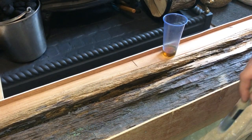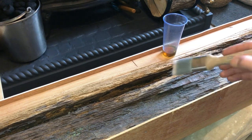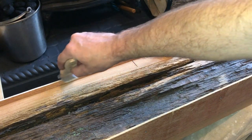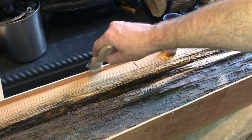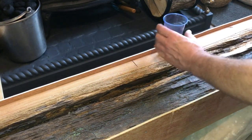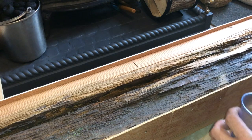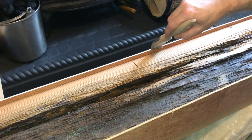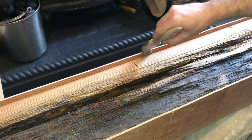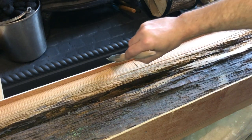What I'm going to do now is get a bit of oil — just any engine oil or something like that. I'm just going to put a light coat of oil on here, all the way round, so the resin doesn't stick to it and it's easy to get the ply board off when it's all done. But I don't want too much on it because I don't want it all dripping everywhere. Just a very slight bit of oil, just on that edge there.